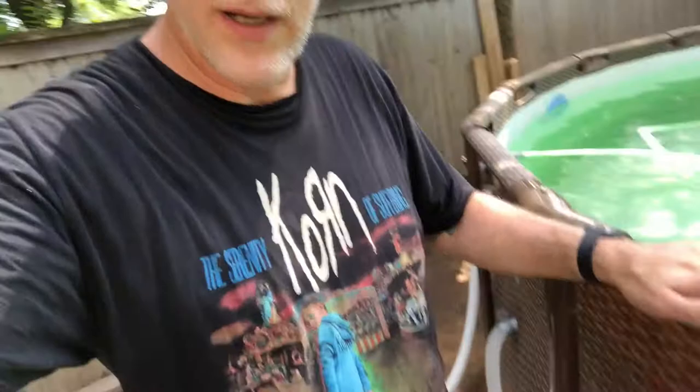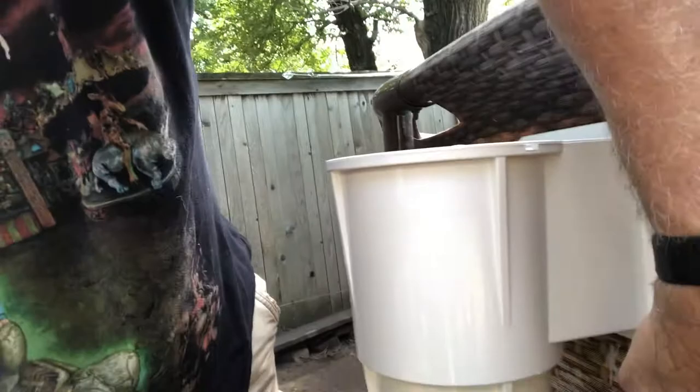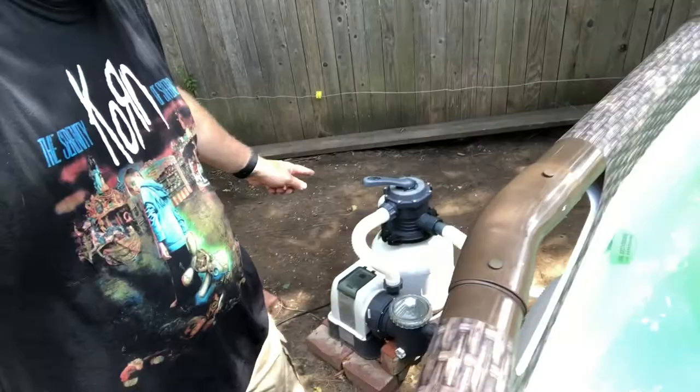It is super humid out here, but we got it in. Don't forget to get this flap in before you start, because you're not going to be able to get it in without possibly breaking it after you get the screws in. Make sure your seal is all the way around when you're screwing it in — you'll know because you'll have a little bit of water leakage as you're doing the screws when the pool has water in it. Put all your screws in and tighten them all up, and next we'll be cutting out this vinyl. But first we've got to hook up the bottom — it's going to need an adapter to connect to my sand pump intake.